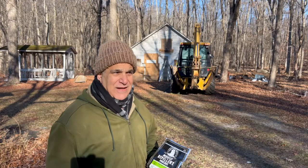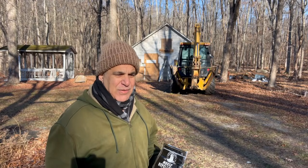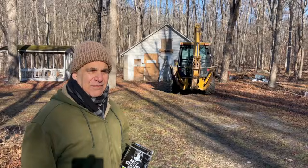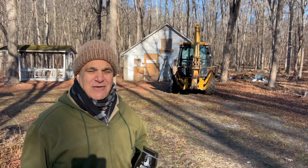So it is freezing. I'm not gonna do a complete antifreeze swap over. The antifreeze that's in there is clean. It's just a tad on the weak side for my liking. So I'm gonna drain out like a gallon of what's in there and put in straight Hi-Guard John Deere antifreeze, 1 container, and that should be plenty for the winters up here. This is Pennsylvania. It gets cold, but I'm protected down to -7, so I add 1 full container of straight antifreeze. That'll get it down plenty, so that I don't have to worry about the block cracking or anything.